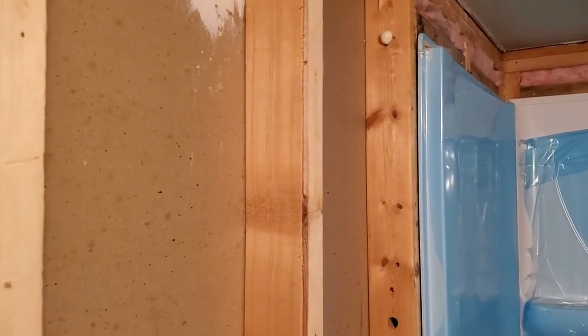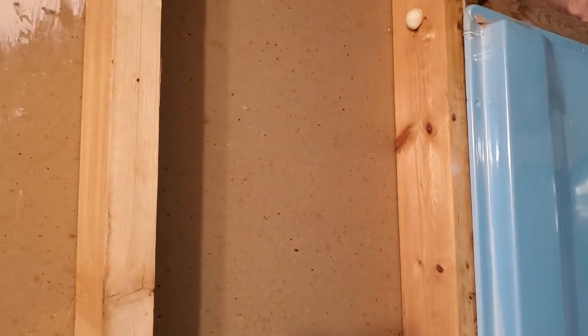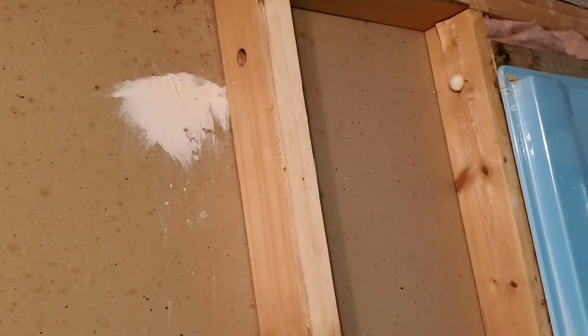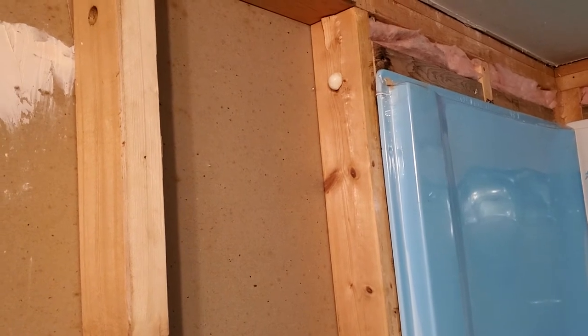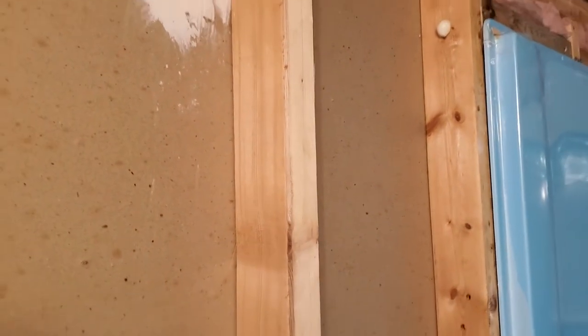It's tight up against the wall, but you have to overlap this nail flange — they call it the screw flange. So you're kind of stuck if you've got to do a remodel and all your studs are true. You can do a new alcove and rip part of those studs out of the way and then just install it flush with the other 2x.